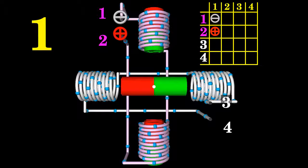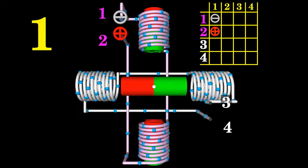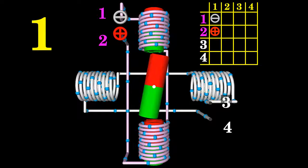Due to the field produced by the electromagnets, forces are acting on the horizontally aligned permanent magnet. The north pole of the permanent magnet is pulled to the top right, the south pole to the bottom left. The resulting torque points clockwise. Thus, as soon as released, the permanent magnet starts rotating clockwise. After some overshooting caused by inertia, the bar magnet comes to rest with a rotational movement of 90 degrees compared to the initial state — the shaft of the motor has moved by one step.